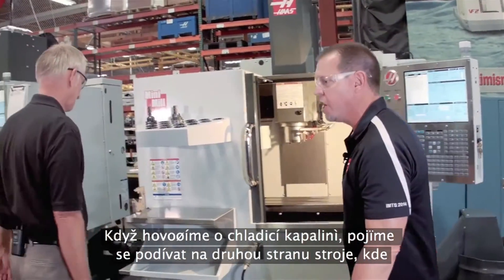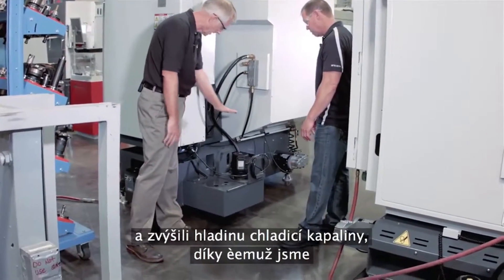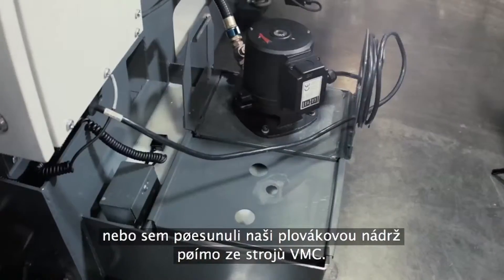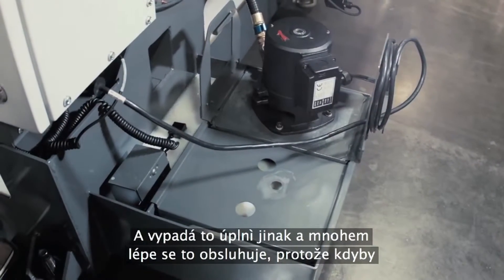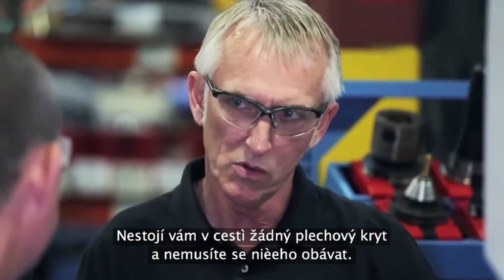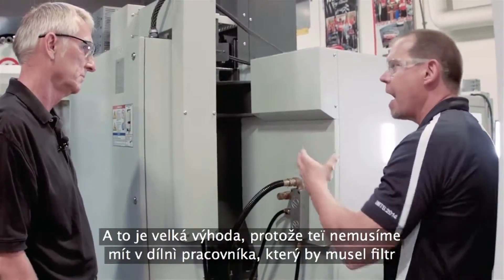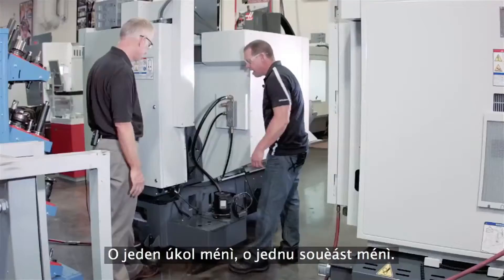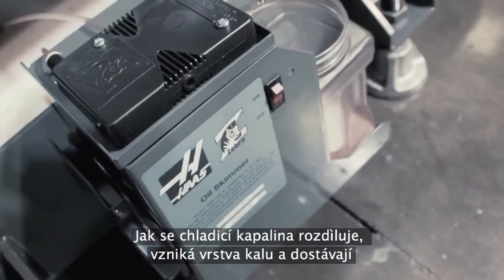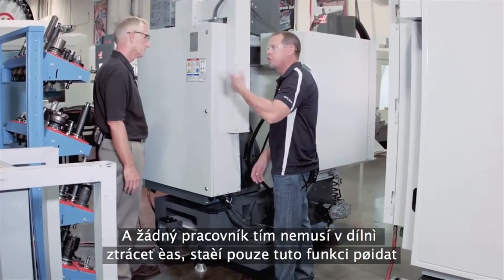So talking about coolant, let's go around the side of the machine to take a look — you guys have actually redesigned this whole section as well. What we did was we brought the back of the tank out, dropped the bottom a little, brought the coolant level up, and that's how we doubled the coolant volume. That allowed us room to put the standard tank here with a TSC side-by-side, or pop in our standard high-flow tank right off our VMCs. This is a lot more user-friendly — where you used to have some interferences, now when you add TSC you drop it straight down with no sheet metal in your way. We also changed how the coolant flows and how we port the coolant, and that allows us to get rid of the filter — one less person having to come back and check that filter daily or weekly, one less part. We've also got an oil skimmer now. As the coolant breaks down, you get that scum layer and floating aluminum chips, and it does a great job keeping the coolant clean. No shop personnel have to mess with the coolant — it just turns on and does the job for you.